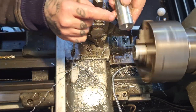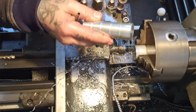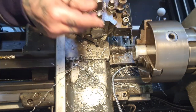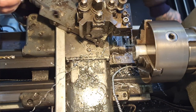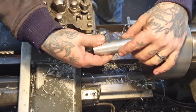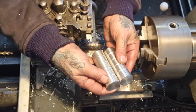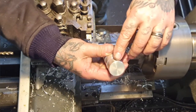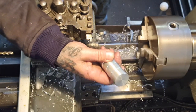We need to put an M8 grub screw — bored out 20mm — where it's going to fit on the shaft, where it's going to tighten up against the shaft. But we'll get the other one done. So we've got both of them — quite happy with them. Yeah, nice. And I've just chamfered that end, just the same as on the toe peg.